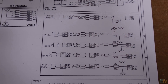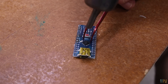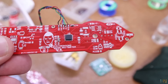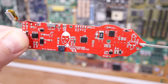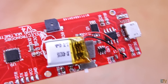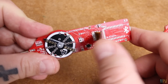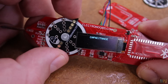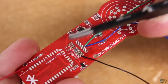I get the PCBs, download the schematic, and solder all the components. I took the chip from an old Arduino Nano clone. We start with the ATmega chip, the resonator, the pull-ups, then all the resistors, capacitors and the sensitive ICs such as the ADC, the op-amp and the current meter. I won't add the Bluetooth module yet. As for the OLED screen, I made a very dumb mistake — I placed it backwards, as you can see it goes the other way around. But don't worry, I've already corrected this error on the PCB that you download. In my case, until I receive the corrected board, I'll solder a separate OLED display with some thin wires, and that should work for now.